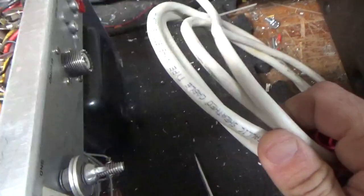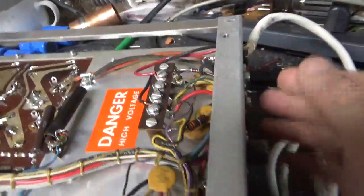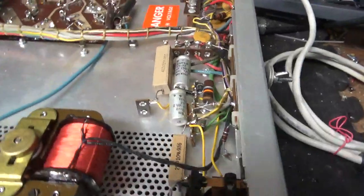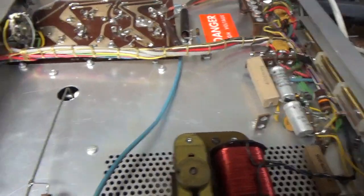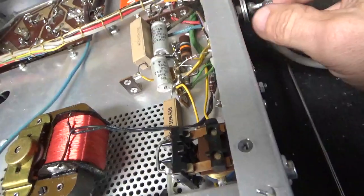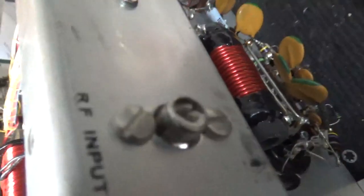He's got a black wire connected back to the LC with a diode there. And here's the power cord — it's house wire, NM-B, rigid wire, going right through the hole with no grommet or anything. I'm going to pull that out and put a stock cord in with a strain relief. I'll change these two capacitors. I already checked the SO239 — it's good. I'll also add an SO239 for the input from MaxGain Systems, instead of the RCA, since this one's damaged anyway.